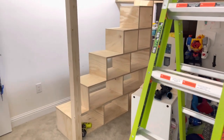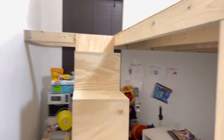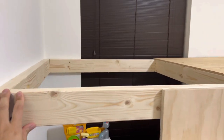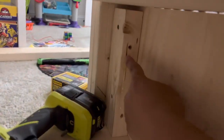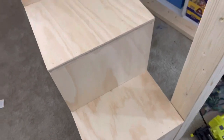Here's what it looks like after finishing. I had a change in planning — initially the stairs were supposed to go all the way toward the window at the top, but I decided to create a little square landing space so the kids have room to walk up before entering their beds. I also decided at the last minute to add a slide. I connected the stair onto the 2x4 frame, and at the bottom of the staircase I used another small piece of 2x4 screwed in with deck screws to the main corner support to hold it firmly.